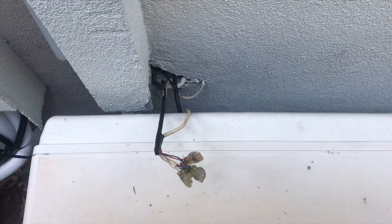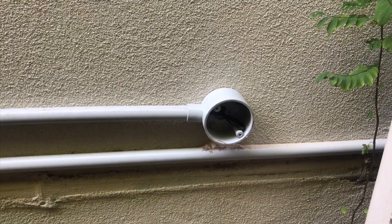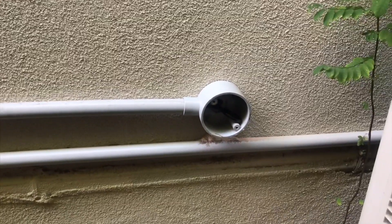So he can connect in a couple of weeks down to where the lead-in cable is. We're going around this little section here — this is a bit of flexible conduit — and then we'll go back off into rigid down to the office end. I've put a one-way box on, drilled a hole through the wall, and got the lead-in conduit cable poked through. It's going all the way back down there, and I'll put another saddle there and that'll be it.